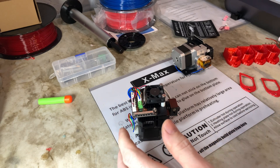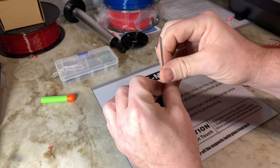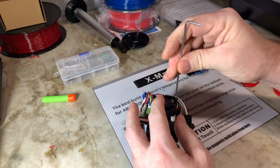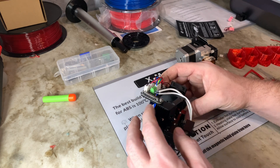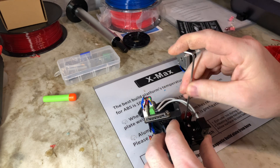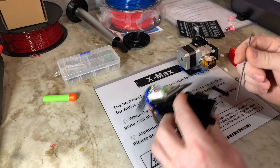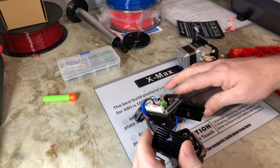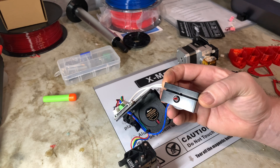Like before, it's hot. You have to start with these two long bolts through the fan. I'm going to rush through this because I have a more in-depth video posted. This is a high-temperature extruder — it should be an all-metal head, though maybe even all-metal heads still have a PTFE tube inside. Pull them out so you can get this heat sink off, then pull the heat sink and the extruder off. And here we are — jammed again, for really no particular reason I can tell.